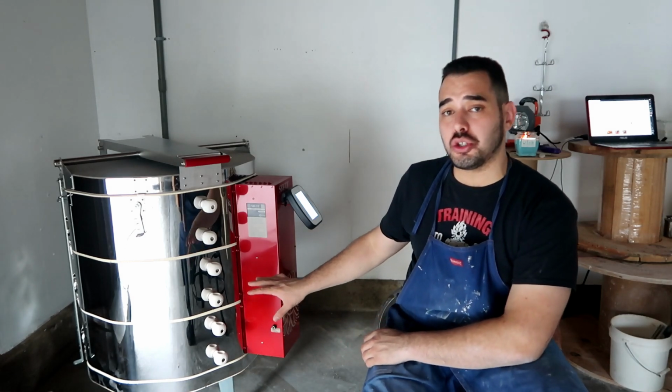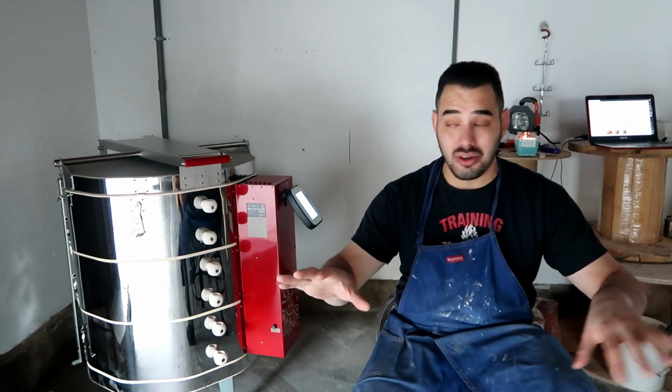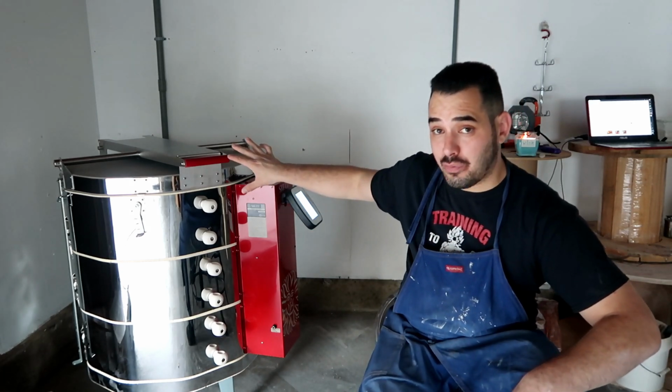There's some things that you need to pay attention to as far as your equipment goes, and then there are some things that really just make it extra comfortable for you to be inside of your studio. For example, if you have someone coming over to your studio and they're gonna build outlets inside of your studio, other than your wall outlet for your kiln, then you should probably have those outlets be a little bit higher than your workstations, because you don't want clay and muck in there. And that's a really important one that a lot of people don't actually think about. Imagine working on your wheel and having your computer directly beside your wheel. That computer now has a half-life.